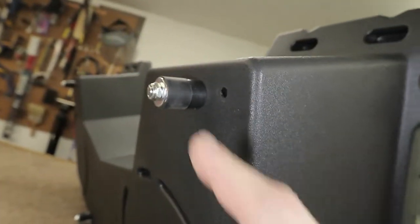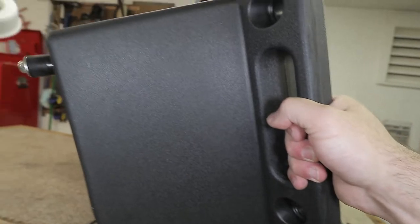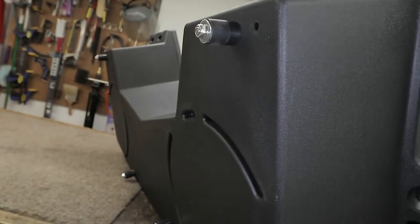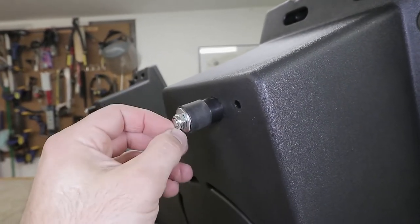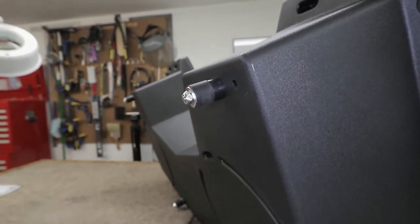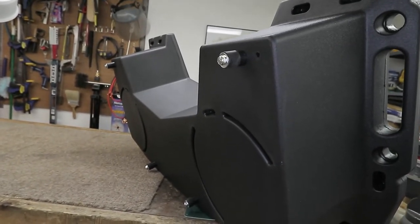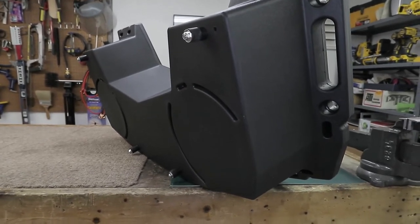This is going to take some time. Adjust all four to the point where when you lock them down and pull up on the box, it does not come off under pressure. Use a half-inch wrench and get it nice and tight. A lot of people will misadjust these too loose. They'll settle over time, so go initially a little tighter than you think you need to — they'll break in and settle. This is the key to keeping the box on your machine, because a lot of people have issues with boxes coming off due to improperly installed and adjusted expansion anchors.